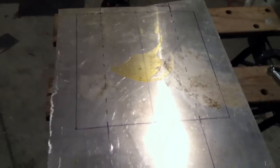Alright everyone, welcome back again. What I've done here, next step, is kind of draw yourself a template. You can see there the wings on the side, like this one, will actually fold in, so it'll be like a corner of a box. Same thing with this little portion right here. This will be the back, so I won't be hitting as much, hopefully, going backwards, so that's just going to be bent up at an angle, and that's also where I'm going to bolt on this little makeshift bracket. And then the side over here, of course, will be bent up to complete that portion of the box.